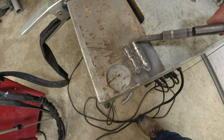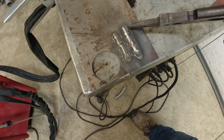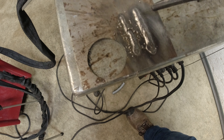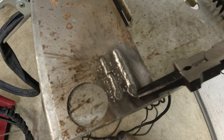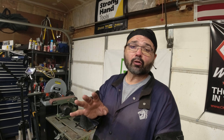You can tell those went down entirely different. Once you adjust the settings right — when you run flux core on electrode negative like you're supposed to, versus trying to run on electrode positive — you can see all the slag because it's just not running properly. You'd also be able to run a little thicker material on flux core versus gas with a 110 machine. It just takes a little different technique.